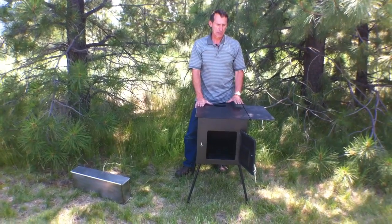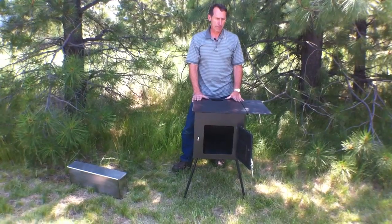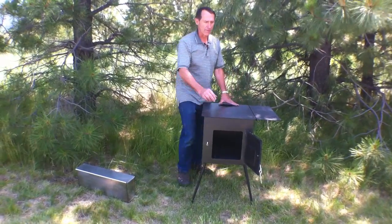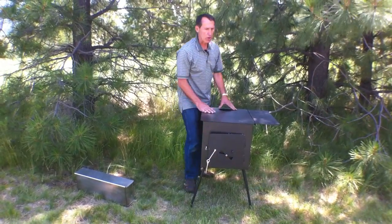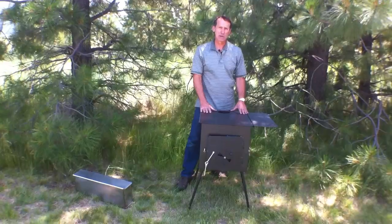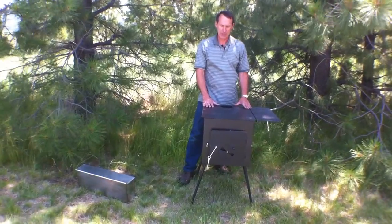When you get your stove, it'll be freshly painted. There's a system called curing the stove. Curing means that you're going to bake the paint onto your stove. When you do that, you want to have about 1/2 the firebox filled with wood, and then have your air intake open about 1/3. What that does is cause a slow burn, and with that slow burn, again, you're baking the paint onto the stove. When that's occurring, you're going to have a noxious smell. And you want to do this outside of the tent so this smell does not permeate the canvas and you have a tent that smells like burnt paint.